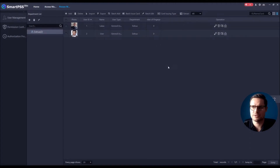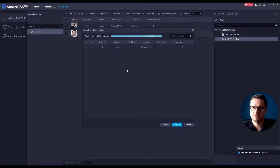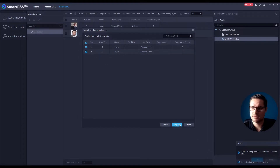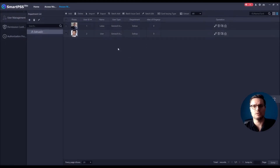There's another option for exporting the configuration of the unit. Imagine you have one unit on site and you get a new laptop — the software doesn't contain any information. In that case, you can extract information from the unit's own database. At the top of the page there's an Extract button, and you can select one or both units to extract user information. This pulls all the information about users already enrolled on the device, and from there you can share it with other units and configure groups again.